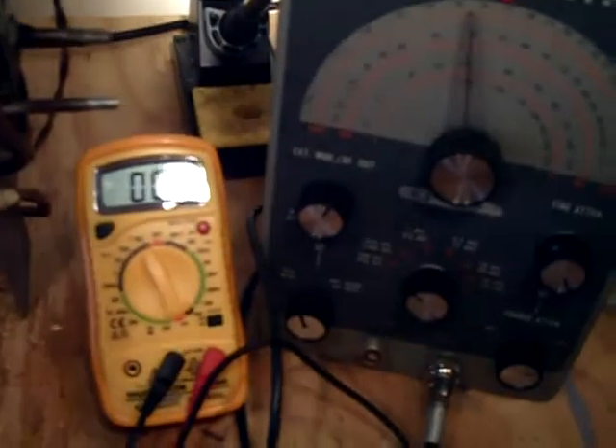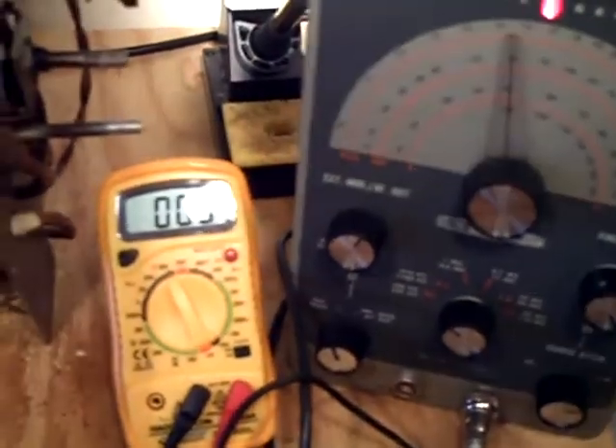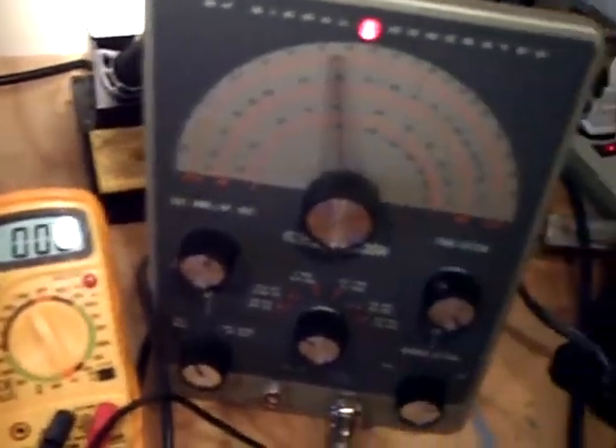There's also a handy diagram from RCA — or John F. Ryder — that shows the transformers and where the oscillator and RF adjustments are in each transformer for each band. That's really, really critical; you've got to have one of these.